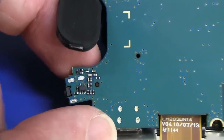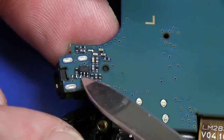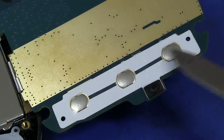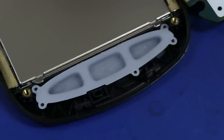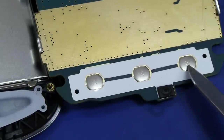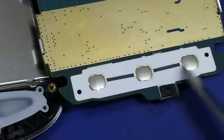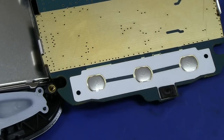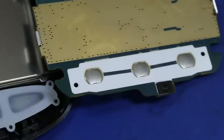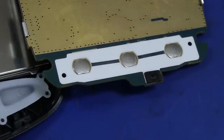Of course, there's absolutely nothing on the backside of this board, except they have done a double-sided load — and clearly that's just the little headphone driver amp there. And some cheap little tactile domes directly mounted on the board there for the buttons on the front of the case. You're not going to get any more than that, because these tactile domes are ridiculously cheap. You can get them pick-and-place soldered directly on the board, or individually, or as a complete sheet that sticks over. Very cheap manufacturing process, and it works just fine. Some of these tactile domes, depending on the manufacturer, can have incredibly long operating lives.